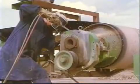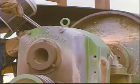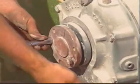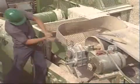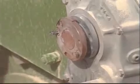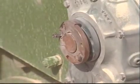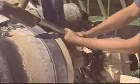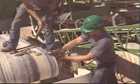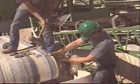A frozen original straight bore connection may be all but impossible to release. And even single flange taper or twin taper connections can shear fasteners or break flanges, making it necessary to sledge them off. The cost of such repair, in terms of delayed production and damaged equipment, not to mention frayed tempers, can be high.